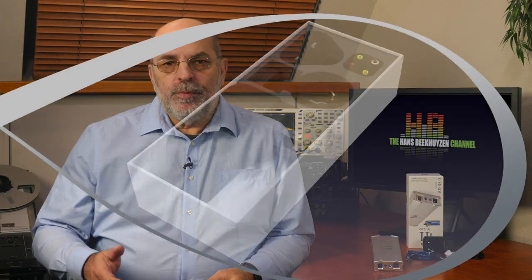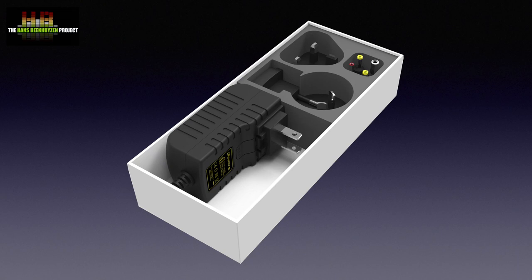Talking about power, the Micro iUSB 3.0 comes with a 9-volt iPower wall wart. This is an audio grade switching mode power supply. I have reviewed the 5-volt version and found it about as good as the Audiophonics linear power supply. Apart from active noise cancellation and filtering of the power supply, the USB signal is also reclocked and regenerated, and both are done at a higher level compared to the Nano iUSB 3.0.